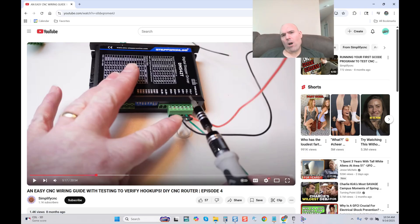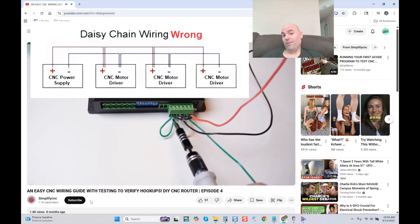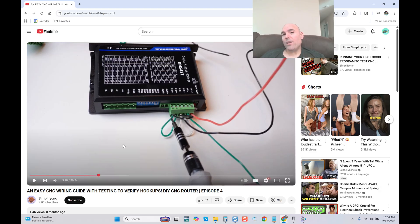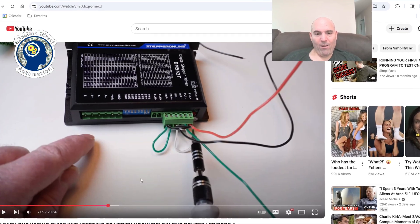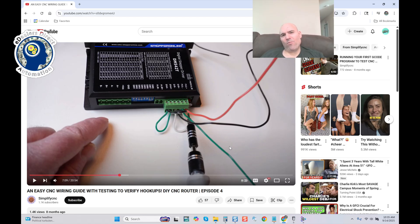Here he is in Episode 18 explaining how to wire your CNC drives. We've got two wires — a green and a black — hooked into the same terminal, and he says he would twist them together. We should never have two wires going into a single terminal block — these terminal blocks are designed for one lead. If you have any background in electronics, this is terrifying. Look at the amount of leads he has terminated there. How do you trace anything back to a failure? He's not reading the user's manual that comes with his drives. There is no driver out there that will accept that. That is not best practice.